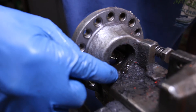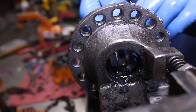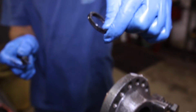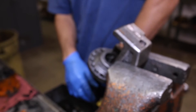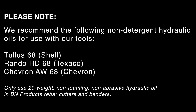Step 14: Remove the inner seal. As you can see, this one has been leaking for some time. Just take a flathead screwdriver and from the rear of the unit, gently tap to get underneath the seal, then lift up and remove. Finally, pivot the unit and allow any remaining oil to drain. That concludes the disassembly of the DC20WH or XH rebar cutter from BN Products USA.